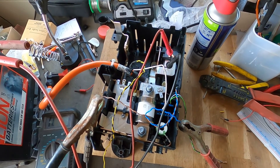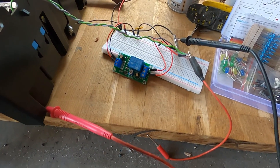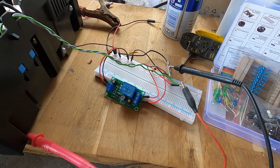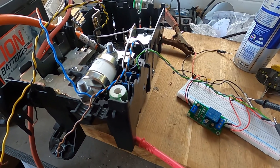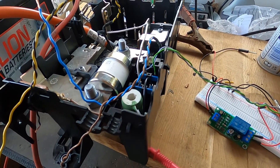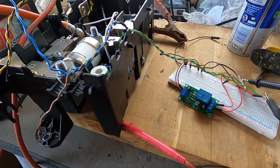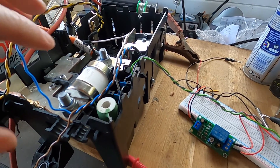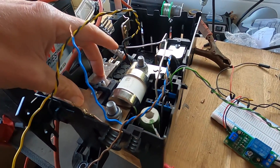What I've got to do now is get a delay circuit built in — that's my next job. I don't know if I mentioned earlier, but it's really important: you can't just chuck 400 volts straight through. You need to what's called pre-charge the circuit, and you only need it for like a second, just to make sure that you don't have a huge current draw coming through your contactors — otherwise you're going to weld your contactors shut.